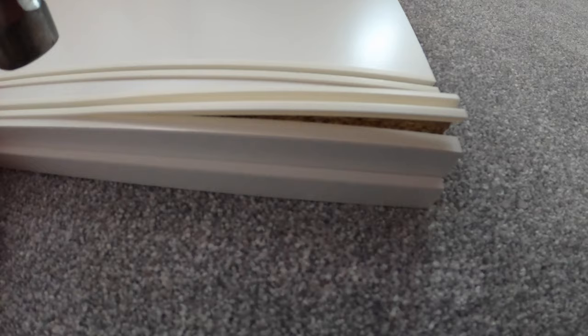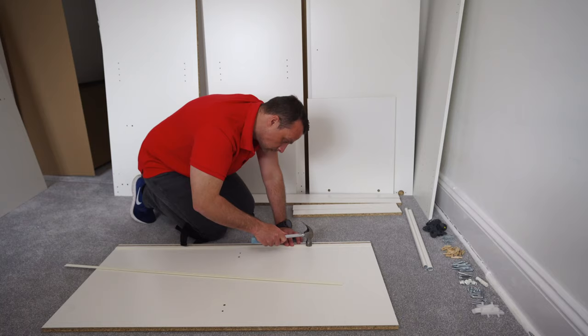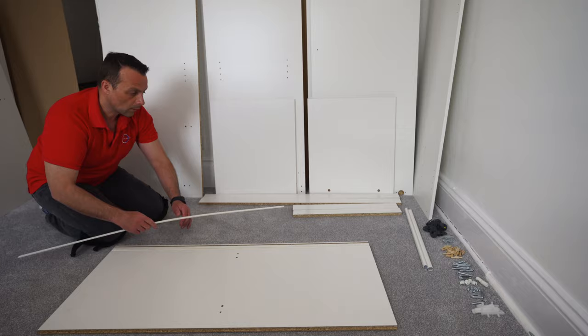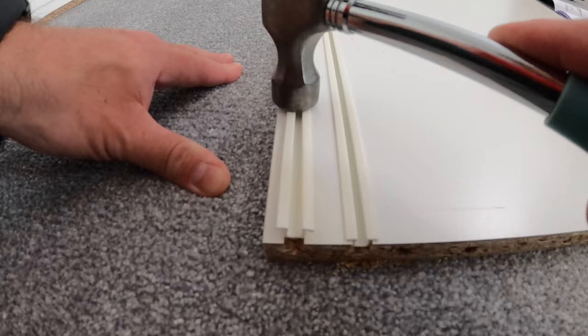The best thing is to place all the plastic in without pressing, and you'll see one side and the other side lining up nicely — about one millimeter from each side. Hammer them in gently; this is just a plastic rail so you don't want to break it. A rubber hammer would be even more useful here. Make sure it's all the way in with no bumps, ending just one millimeter before the edge of the panel.